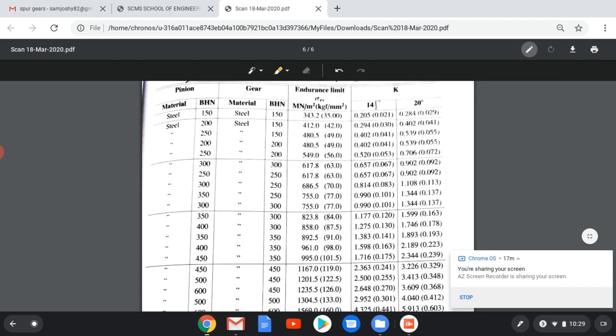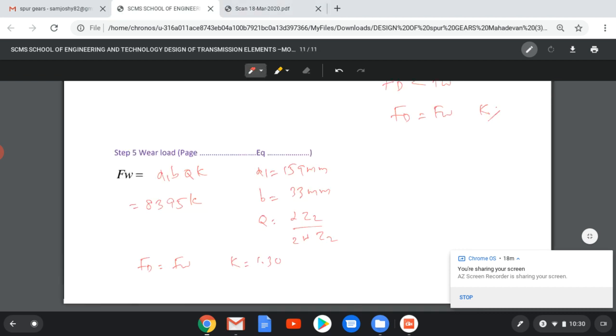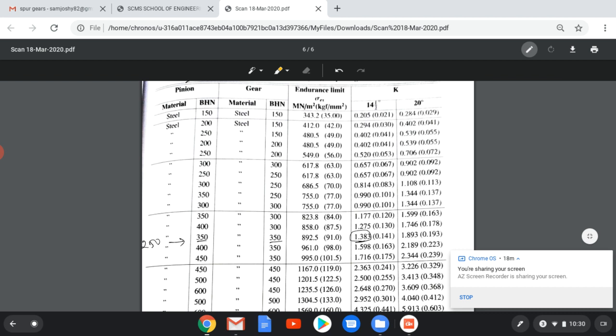So 1.275, after 1.275, it is 1.383, that is the required value. For that, pinion and the gear should be heat treated to 350 BHN. What was the initial hardness? 250 hardness. So in order to use this value, 250 BHN should be heat treated to 350 BHN for both pinion and the gear. So we write here: pinion and gear heat treat 250 to 350 BHN, so that we can use the new value of K,